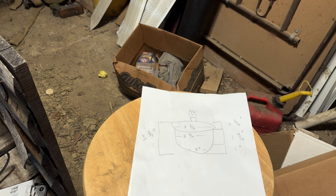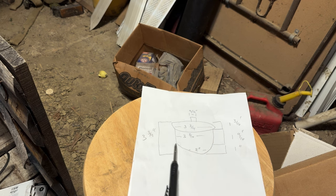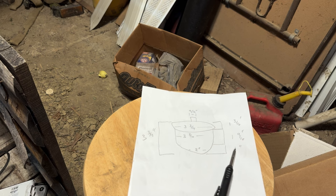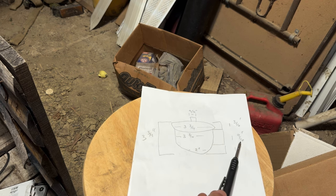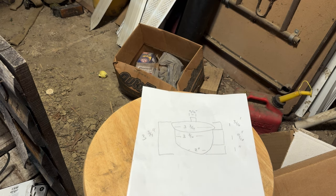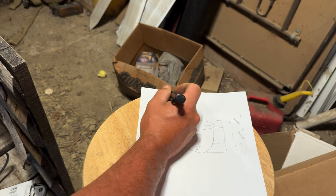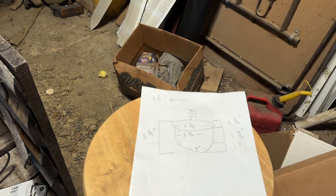So now I have a full scale: the acorn will be three and three-quarters tall and three and three-quarters wide. The flat part underneath the cap is three and three-sixteenths, two inches halfway into that area. The five-sixteenths is now one inch, the half inch is now an inch and nine-sixteenths, and so on. Those are my dimensions for a three and three-quarter inch acorn — we'll get started and I'll show you how I use these and my calipers to make these post tops.